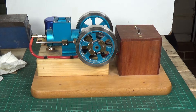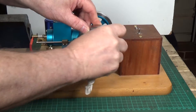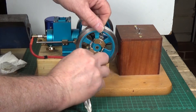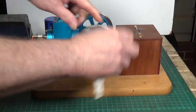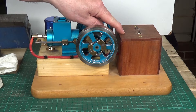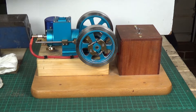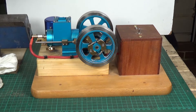After discovering on the new MK2 version of the Banggood hit-and-miss engine that the ground wire on the chassis is actually connected to the battery negative, I've been into the ignition box on this one and swapped it over. I had the ground wire from the chassis connected to the case of the ignition unit, which is metal, but the case of the ignition unit is not connected to the battery negative.